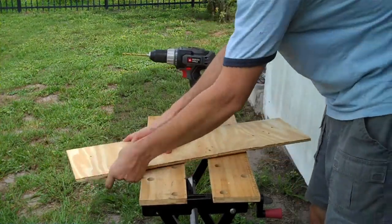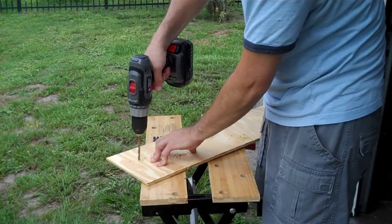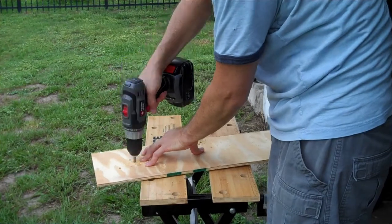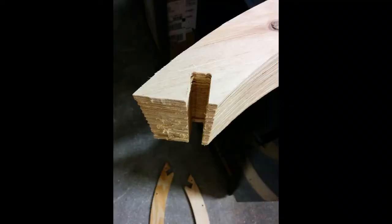I was making 32 of these pieces, so I decided to use the Maslow to cut them out, but to drill the holes manually using a jig I also created using the Maslow — which is just a pocket the same size as the part with the holes pre-drilled in it. I cut all of these parts facing the same direction, and you can see that they align nicely when stacked up.